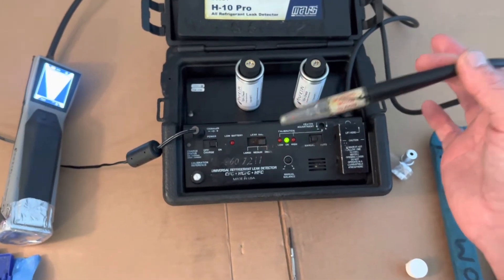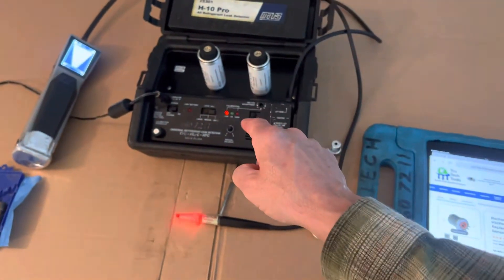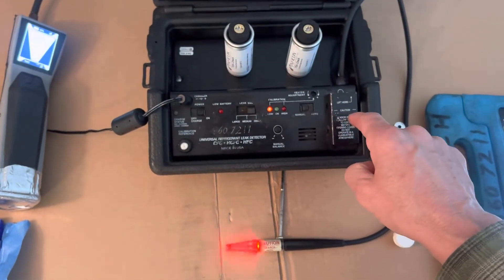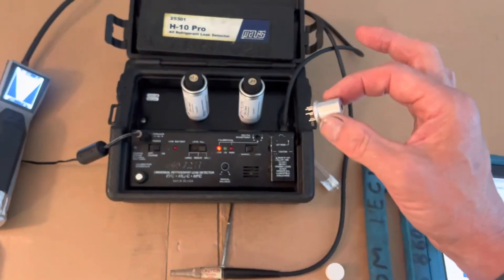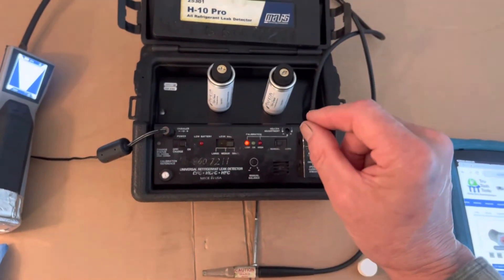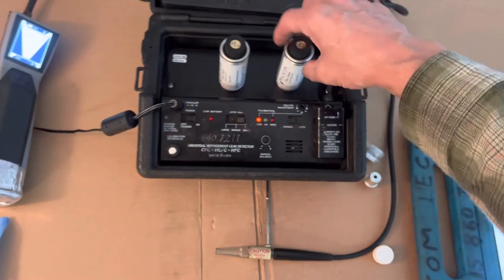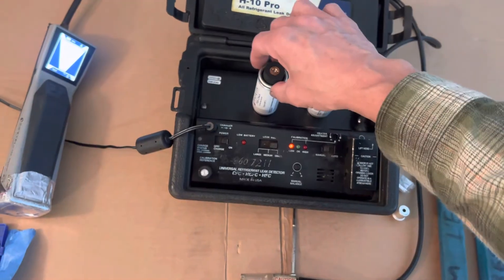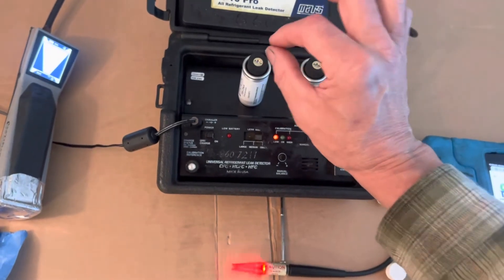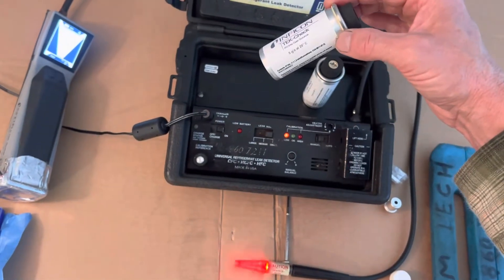So that's the basics. I gave you the information to go look up how to properly adjust. If you have one of these, go through the calibration mode with your old sensor. What I discovered: my old sensor is still good — I was very surprised — but the new sensor is a little bit more reactive with the R134. With my old sensor that was eight years old, it was doing really good with the YF refrigerant, but when I came over to the R134 it was having a little struggle — it was working, but very slow in response and very weak. After changing the sensor, it is now very accurate and very sensitive on the R134.